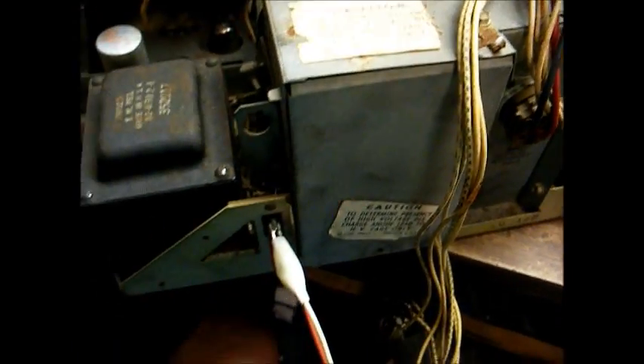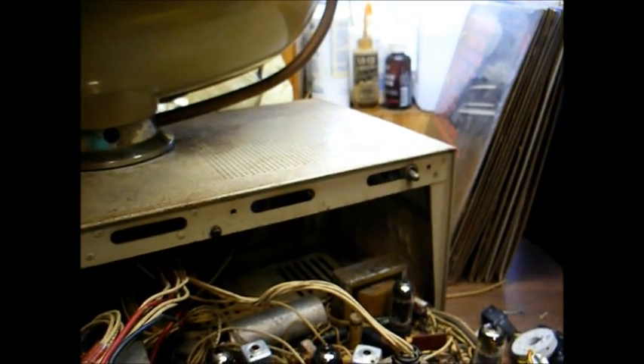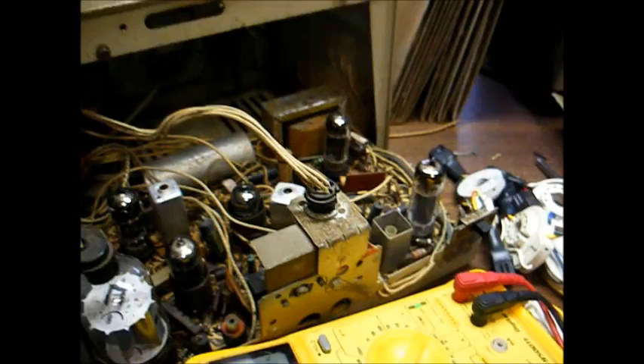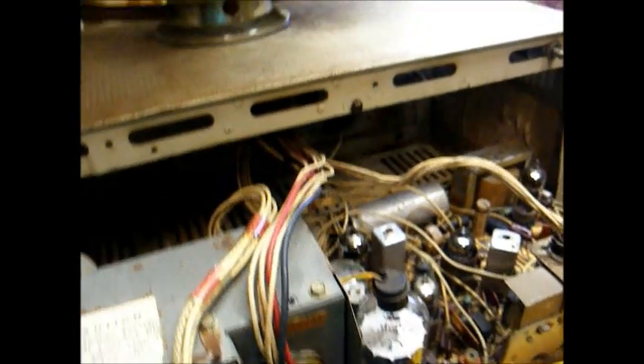These fusible resistors weren't that great in the first place. They're made out of some kind of grainy material — I always called them sand resistors — because the body absorbs moisture. You can see this one is all corroded and busted in two, likely from a combination of heat and moisture. We now have continuity across the AC input — apparently I had to flip the switch a few times — and we're reading 3.2 ohms across the primary side.